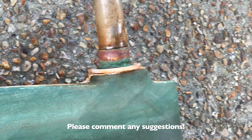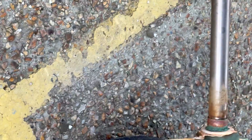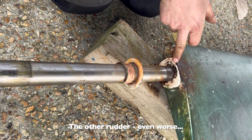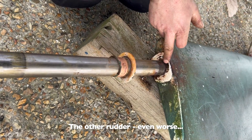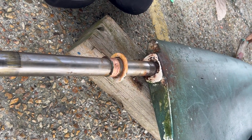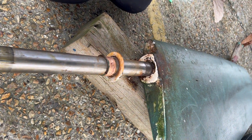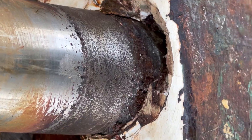Clearly we're going to need to find another lower bearing that isn't made of copper, but it's gone through and now caused a dissimilar metals breach between the two components. I mean, that's some serious corrosion — I would not expect to see this. This is eating the stock away — that's crazy.